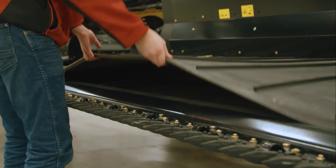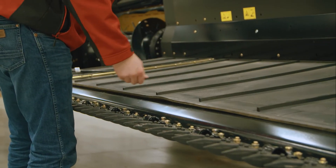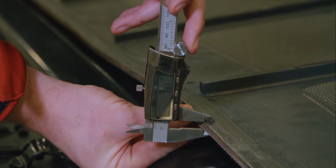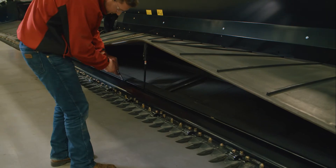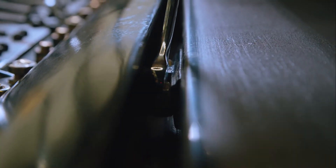At the first draper deck support, lift up the front of the draper and take a measurement of the front edge of the draper belt for future reference. Now loosen off the two deck support lock nuts by half a turn each to allow adjustment of the deck support height.